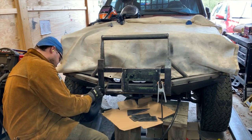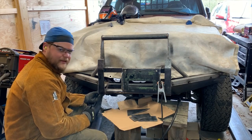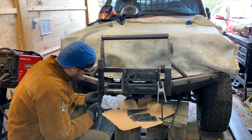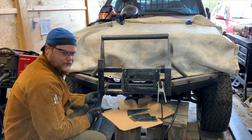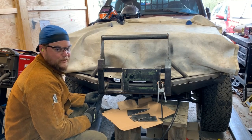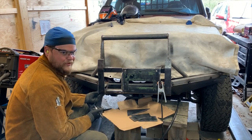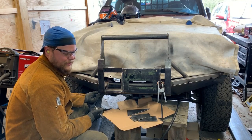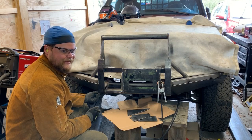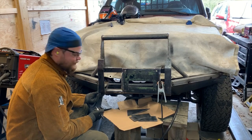What you can't see is I'm offsetting this slightly, so I've got some room to actually add some weld without just building on the surface. While it's tempting to do that and then grind it to make it look nice and smooth, because you're learning, your welds are going to suck. You're not going to have any room to do any grinding. You're just going to grind your weld out and have something that's held on there with a wish and maybe a bit of bubble gum.